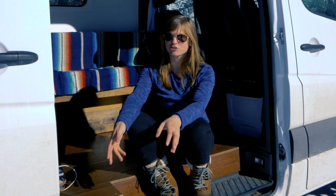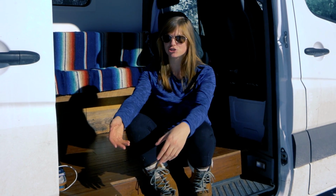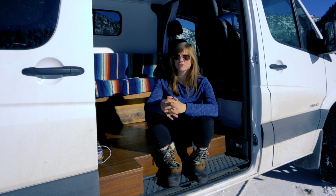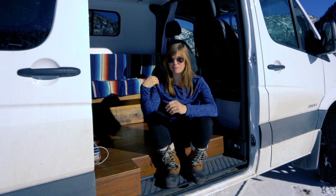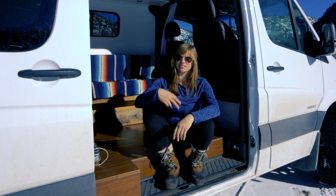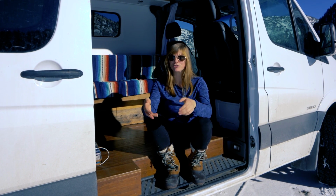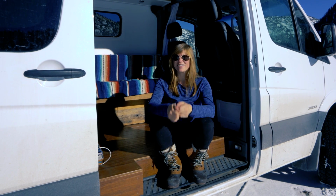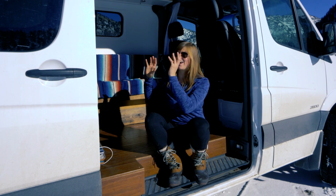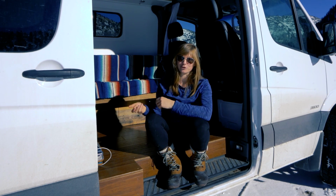The final piece of your electrical system is a meter that tells you the current status of your batteries and how much you're drawing. Mine came with my inverter. It's the Magnum Energy meter that I have on my wall there. I also have a Midnite Solar reader, which is under my couch. That's connected to my solar panels. If I was going to do it all over again, I would just get the Zamp controller, which comes with the solar panels. They sell different kits, but I started out with a different set of solar panels and had all this equipment already in here, so it didn't make sense for me to replace the entire controller when I got the new panels.